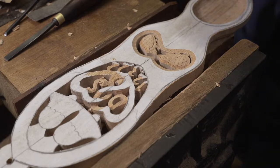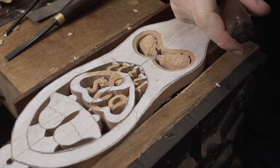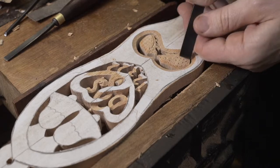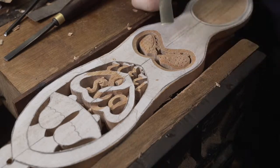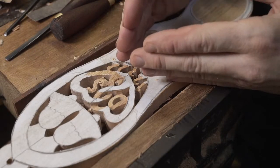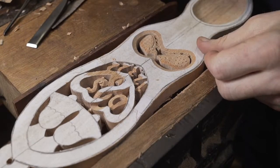They might be surprised at this answer - you have to use quite a low grit, really. You're using sort of 40 and 80. But you then have to go back over it on 120 and 150 to get rid of the lines. To remove the paper, you've got to use the 40, which is quite coarse. But going with the grain, just be gentle with it. It takes the paper off and you've got the glue underneath as well.